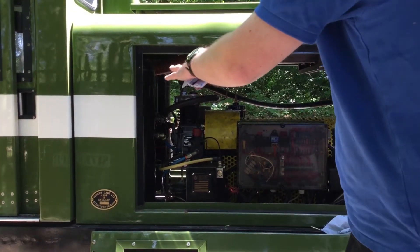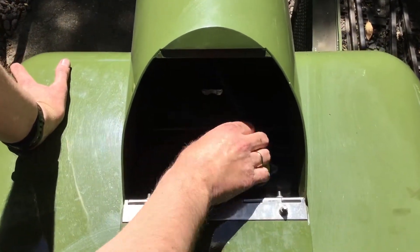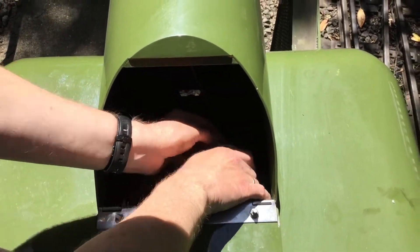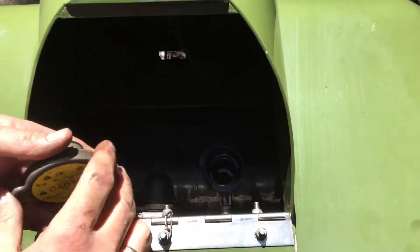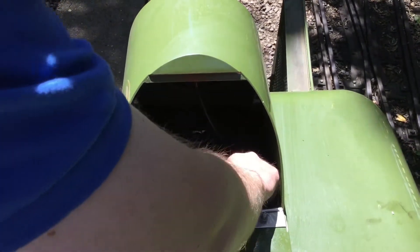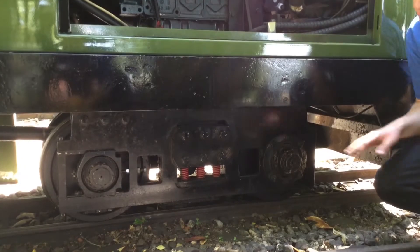That's all the oils checked on the engine. Now we're on the top of the loco. Next thing I need to check is the filler cap for the radiator — this is where the coolant is. Get it undone and just check there's plenty of water in there, as we can see — so that's all right. Put that back on. You should only do this when it's cold; getting it out from the shed won't make it very hot, so that's fine. Do it hot and there's a lot of pressure, so we don't tend to do it in the middle of the day — just do it at the start of the day. Cap's secure.